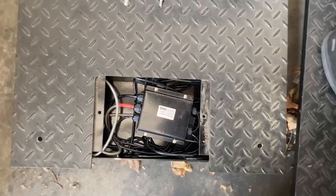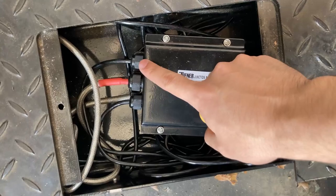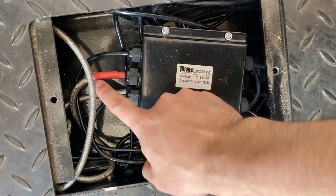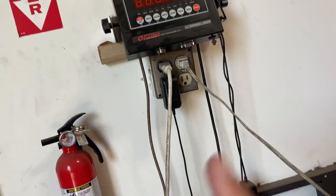This is the overhead view of how this compartment looks. You'll notice a junction box. You'll see four black cables, one for each load cell, and the gray cable that comes out of it — that is for your connector that connects to your 902 indicator or OP900 indicator.